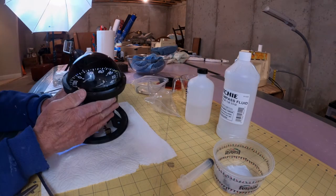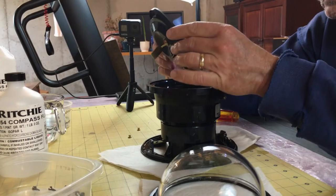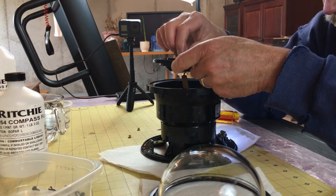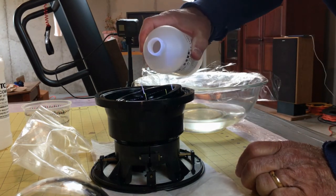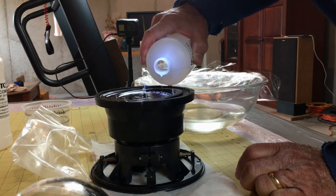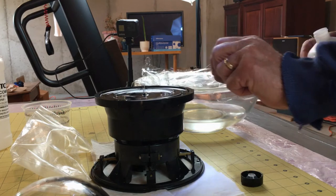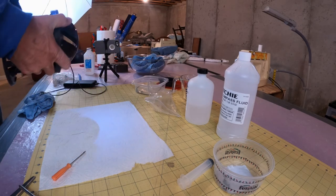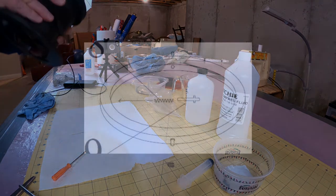But I couldn't live with a gimbal and compass card askew. Did I damage the gimbal? I drained the fluid and checked it — it was fine. I refilled the compass and it was still askew. Did I have a bubble under the gimbal? I drew down the fluid again and this time filled the bowl to its brim, trying to keep a bubble from forming. That didn't work either. The final solution was to turn the compass upside down so the gimbal jammed and no longer gimbaled, allowing the bubble to escape from under the gimbal ring. I'm pretty sure the gimbal jammed when I started with one of the gimbal bosses straight up.